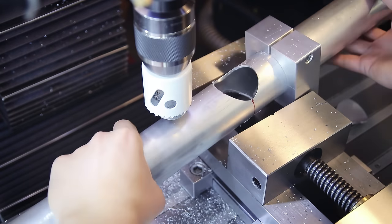Next I'm drilling the mounting holes and also a whole bunch of other holes that people in the bike world sometimes call speed holes — they don't really serve any purpose other than slightly reducing the weight and making things look more interesting. For the miter cuts I'm going to use the same method I used for the last part — cutting straight down the center to miter and separate these parts in the same step. But the hole saw doesn't have enough cutting depth again, so I need to flip the part in between and go from both sides.